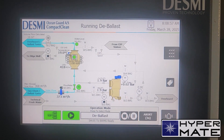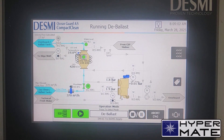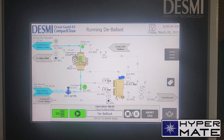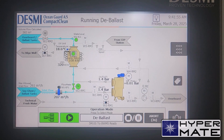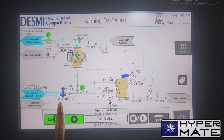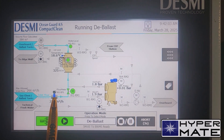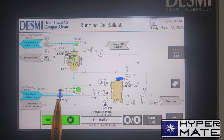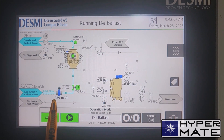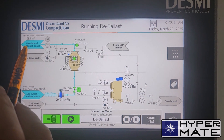I will go back — when I processed the plan it was about 500–550 cubic meters. One and a half hours have passed and I see that the flow is starting to reduce and even jumping — it was just now 150 to 300. This means we are getting air into the system, which means the tank is about empty. I de-ballasted more than I planned.